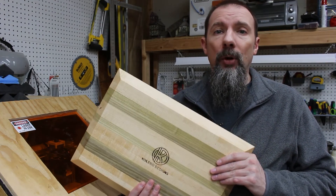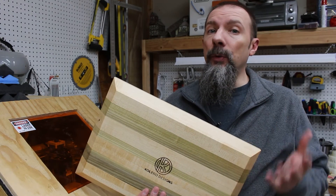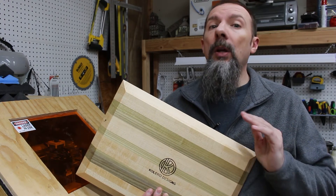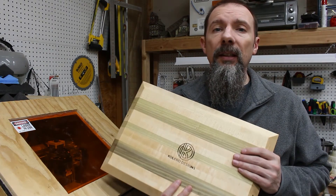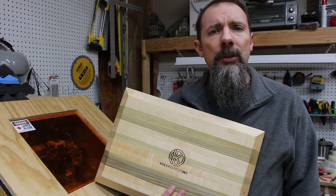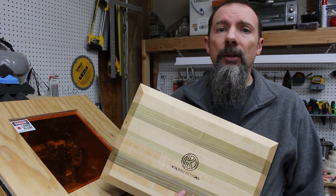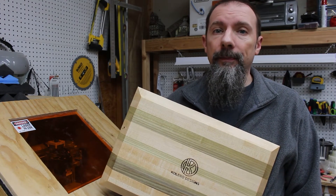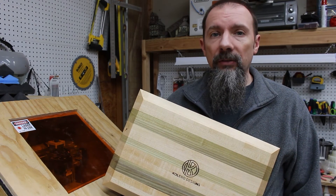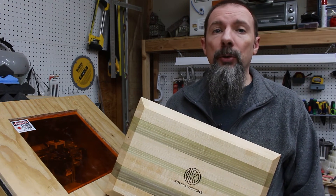For me, Borax doesn't make sense on cutting boards for two reasons. One, you don't clear coat a cutting board with a permanent finish — you use something like mineral oil or beeswax and mineral oil combined, which wears off over time because it is food safe. If I put a clear coat finish on it, over time it would crack and it may not be food safe. The other reason — and I didn't think about this when testing — is that you're introducing a chemical into a food preparation surface. Probably not the smartest idea. I'm not a chemist, but my partner is and she said that's a bad idea, so I'm going to listen to her. That's why I'm not going to use Borax, at least not on cutting boards. Now, if I were to do something decorative, I'd probably use it. My advice: if you want to use the Borax, be careful — it will smudge easily, so be sure you seal it as soon as it's done.